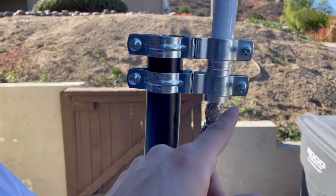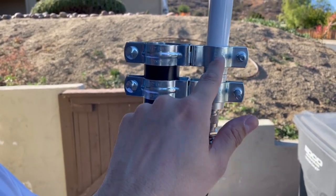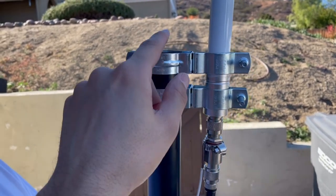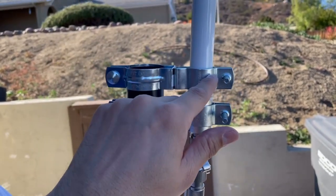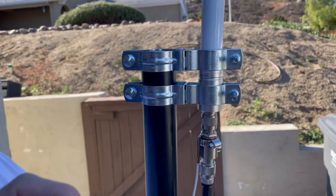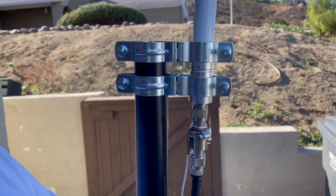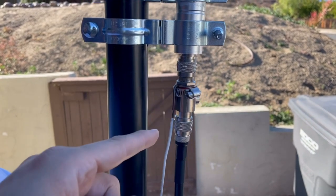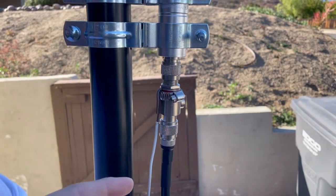One of the things I'm fixing from last time: a subscriber let me know that you can see the bottom of the antenna all the way down at the bottom. What you want to do is clear the antenna all the way above the mount — it's just by a little bit, but anything helps if you're trying to earn the most HNT. We're going to try to lift it as far as we can. Also, the lightning arrester — we bought one that wasn't legit last time, but we have a new legitimate one from Amazon.